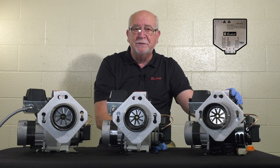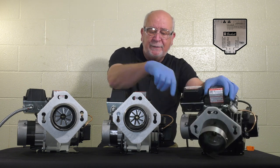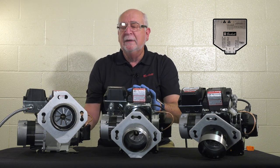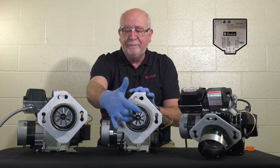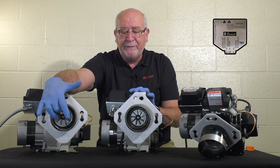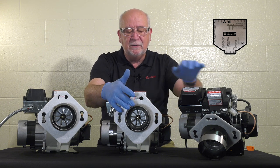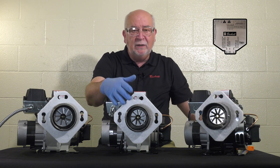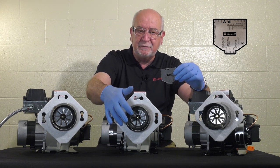There are two different shrouds used on an M-tube burner: the straight shroud and the conic shroud. There are also two different heads that are used: an L head and a V head. The heads may be used on either the conic or the straight shrouds. You need to understand the Z dimension for both of them.